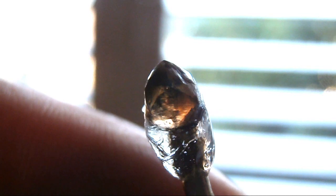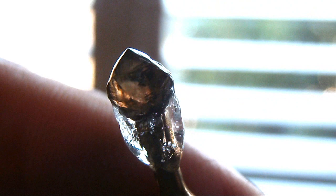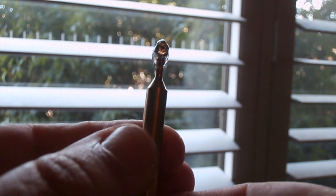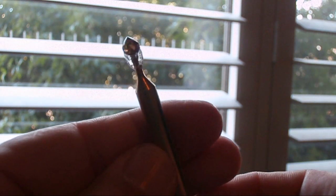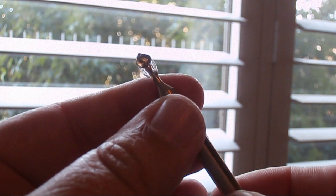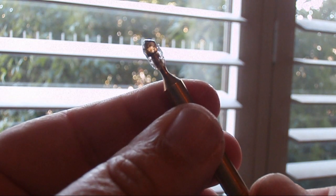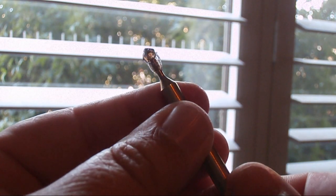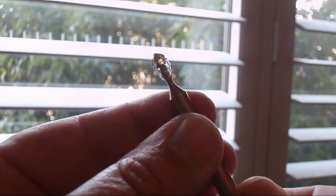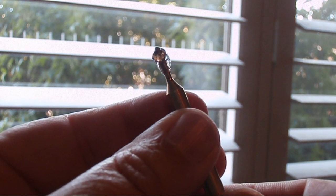Because of its hardness, diamonds are usually cut on specialised faceting machines where they are held within a claw and usually cut on a cast iron disc running at really high speeds of over 1500 RPM. Realistically, I have a pretty big job ahead of me as my machine's top speed is around 1400 at the most, and you kind of need around 1500 or more. It just means that cutting a diamond is going to be really slow.